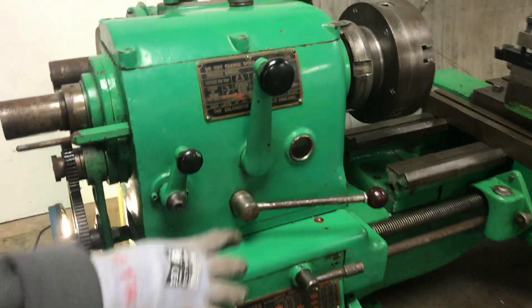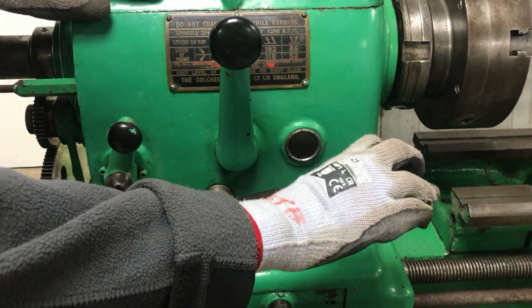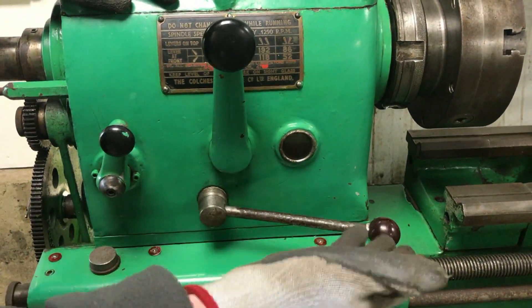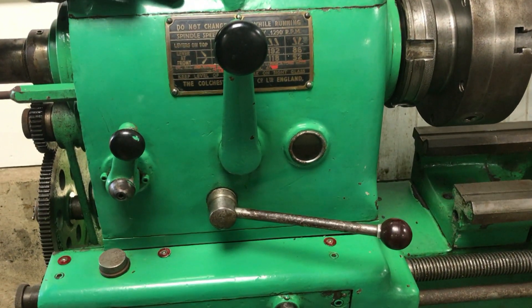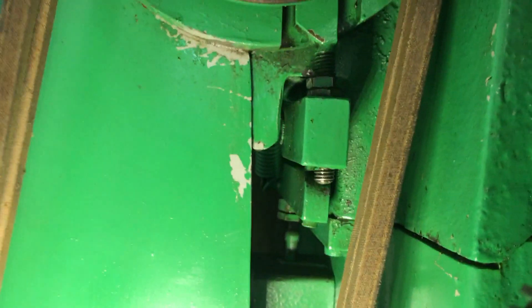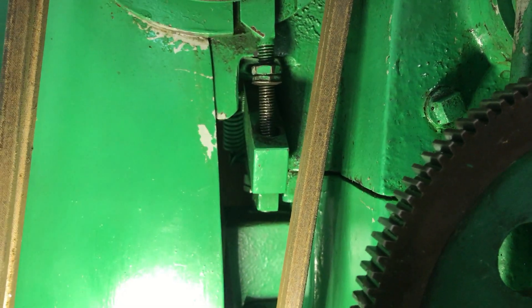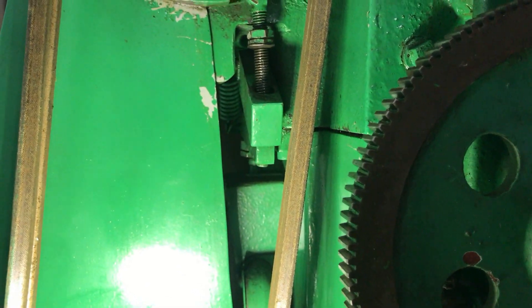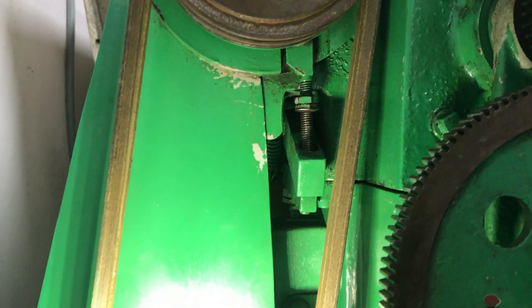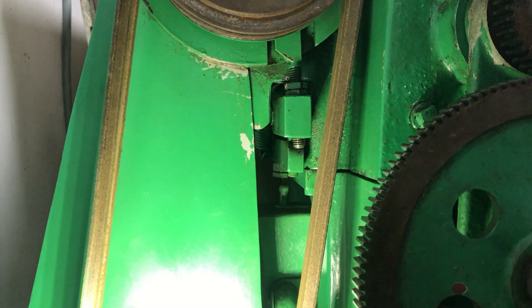Firstly, we'll look at how the brakes work from the front. You've got this lever — when you lift it up, that would be the on position, and then you push it down, that takes out the power, and it's meant to go down further for the brake. However, ours does not go down at all, and in this position it activates the brake, so we've never had a problem with it. From the back, if I move the lever to the on position, you can see it has gone down and there's a switch down and back there that has been pushed down and activated. If I drop the lever, you can see that switch has been deactivated and the brakes have been engaged.